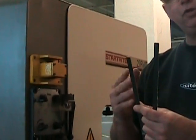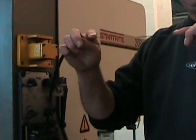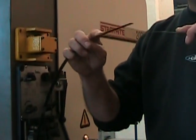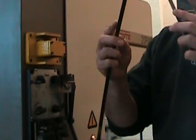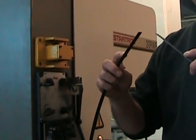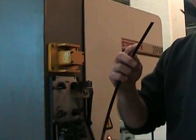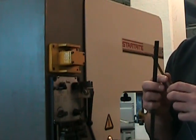We're going to produce here a weld by electrical resistance. So we're going to be forcing the two ends of this bandsaw blade together and at the same time introducing a powerful electrical current. The contact point of this blade is a resistance because at that point, since the blade has been cut, the current won't pass that well. That's going to produce a lot of heat, and it's going to be localized at that junction point. That's going to melt the two ends of the blade, and if we force them together at the same time, well, we will have welded the blade.